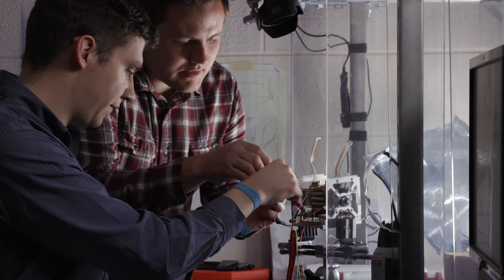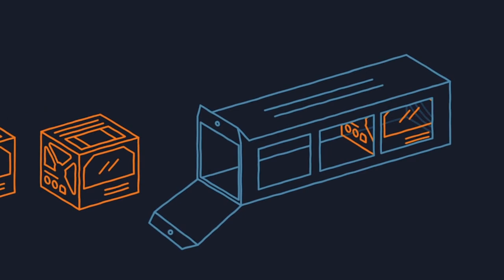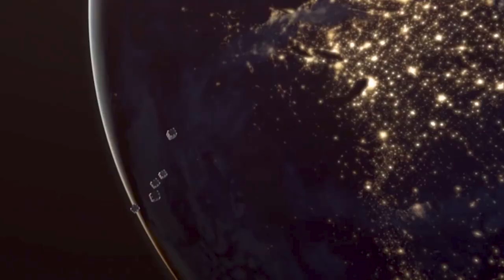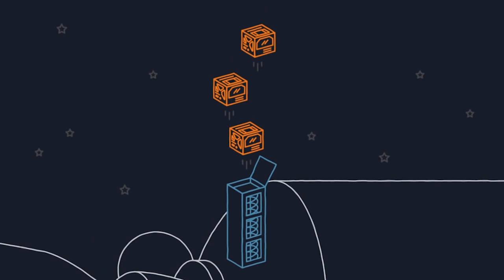There's also some complicated testing that has to go into it. A key characteristic of a CubeSat is it has these rails on the sides. It's loaded in a square tube on the launch vehicle — I like to refer to it as sort of like a PEZ dispenser. The moment the CubeSat comes off the dispenser, it will start booting — the computer turns on, all the microcontrollers turn on, and that entire boot-up process happens within just over a second.